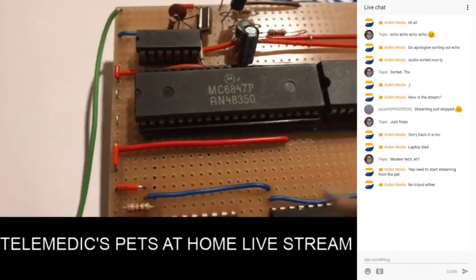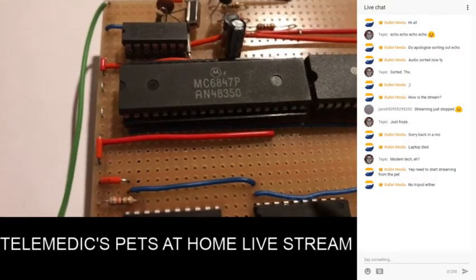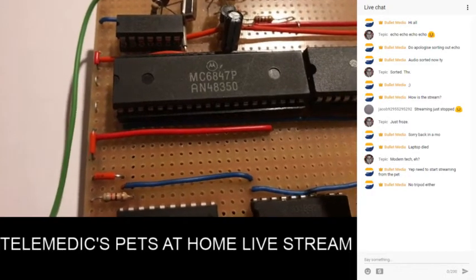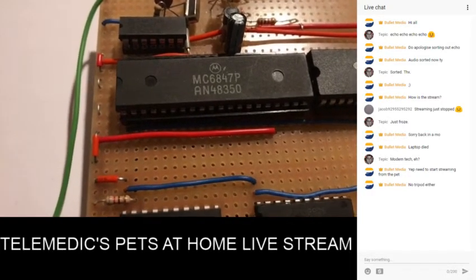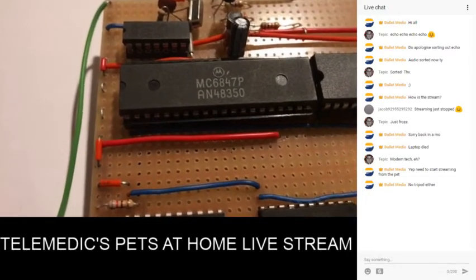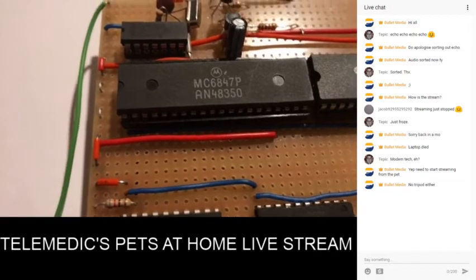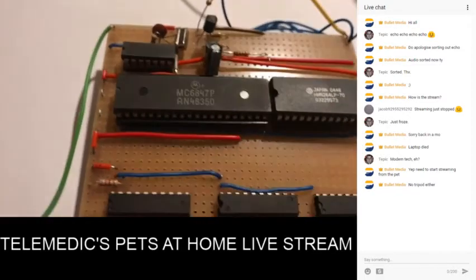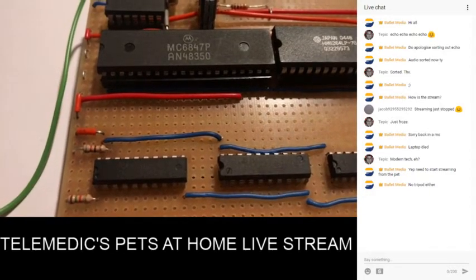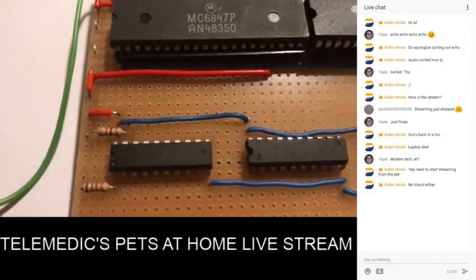So I was confused as to why the only lines that were running were up to about address line 8. And I worked it out that that would only be counting up to 512, and working out that 32 times 16, of course, is 512 bytes. So it's actually only addressing 512, which is all it needed to do because it's locked into text mode only.